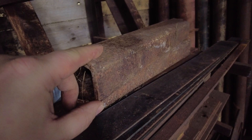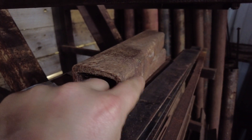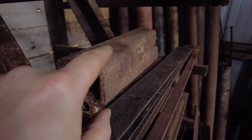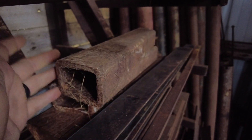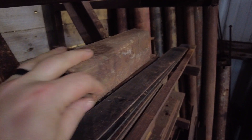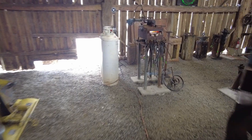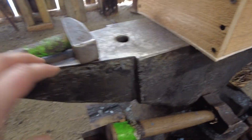If you look at the radius on this piece of square tubing, you get a nice radius — looks like about a half-inch radius. So if you needed something with an exact half-inch inside corner, you could use something like this instead of fighting with it over at the horn of the anvil.